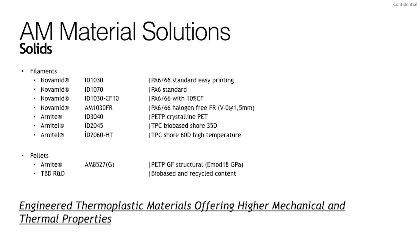The Solius filament portfolio currently consists of seven products: four nylon-based and three polyester-based. The nylon-based materials are highlighted by two higher performance products — a carbon fiber-filled nylon 6/66, which offers 3.5 times the stiffness and 2.5 times the strength of standard nylon 6/66, and a flame retardant nylon 6/66 with a UL Blue card listing. The polyester-based materials include a PET polyester offering higher dimensional stability and two co-polyester-based materials. The highest temperature performing product is Arnitel ID2060HT, tested at 190°C for 500 hours and 175°C for 1,000 hours, making it suitable for the most stringent underhood applications.